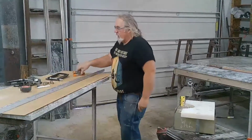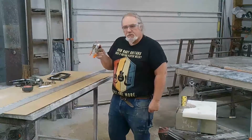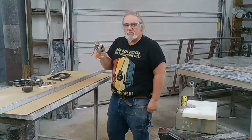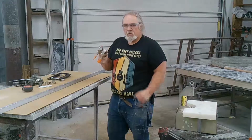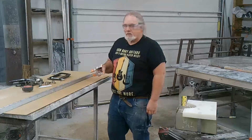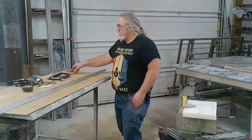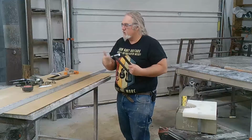So, the clamps. These are useful for some things, but in this particular project, you don't want to use spring clamps because they don't clamp hard enough. If you start putting pressure on it, it'll move. And if you push it too far and weren't paying attention, it would move and you wouldn't like it. So, we have C-clamps, or bar clamps.